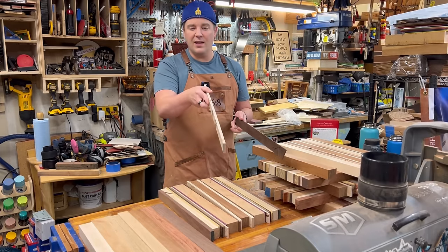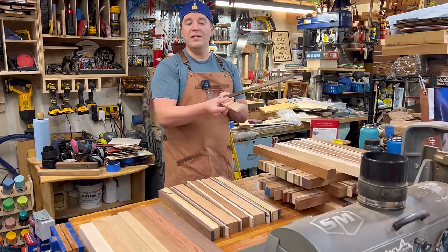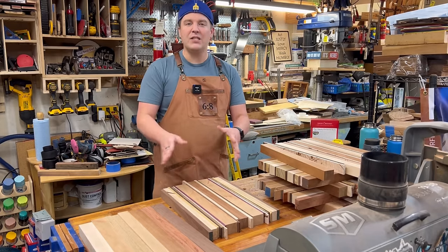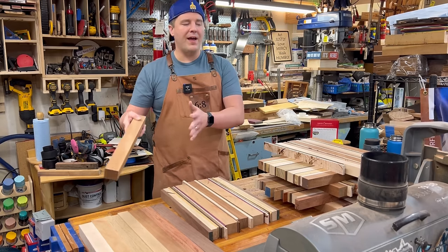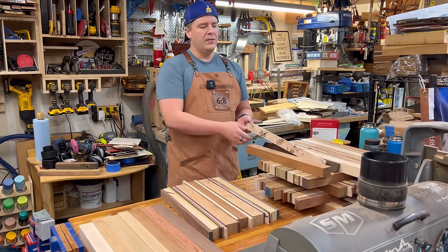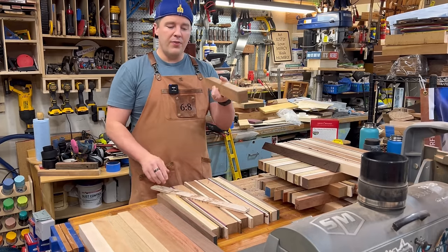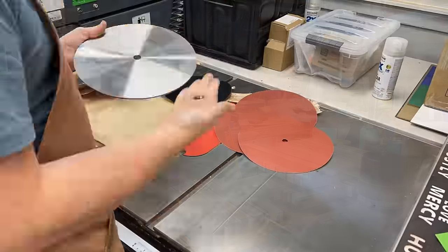When making your boards, you can cut a bunch of pieces — three-eighths inch, quarter inch, thick pieces — get them all made and then surface all of the sides. Or you can jump ahead and make your patterns first, but then you have to surface each side individually, which is less efficient. It's definitely more efficient to get all your pieces in the different thicknesses first, then surface them all. For surfacing, you could use a sander, but it won't be as even. There are better tool options.